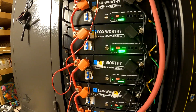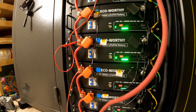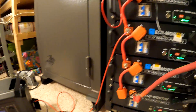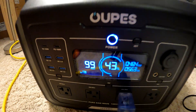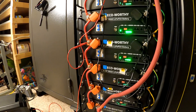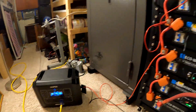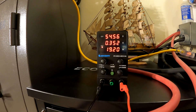Check this out — and don't do this at home. Definitely don't do this at home. Because this was all charged to the max, I needed a way to drain it so I can get the BMS to accept voltage again. So I hooked up this load and I've got 500 watts or so going into it. This guy and this guy together — that's a 30 kilowatt-hour power station for under $4,000. Don't recommend that. When it gets down far enough, I'll turn this off and then we'll see if we can trickle charge and top these cells off a little better.